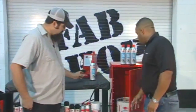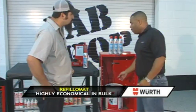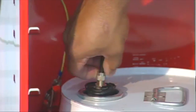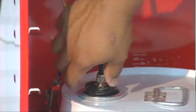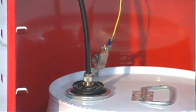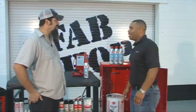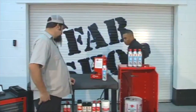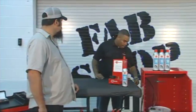Simply, the first thing you want to do is you can hook this system up to either a 5-gallon, 30-gallon, or 55-gallon drum of either brake and parts cleaner or a multi-purpose solvent. First thing you do is connect the actual distribution line — that's what supplies product to the system. Then you connect the static ground cable to the drum. Don't want things blowing up, huh? No, you guys have enough great explosions going on in this place. So let's come around here — you're also going to set up another static ground that comes off the machine to add a grounding line.